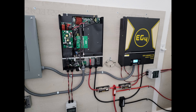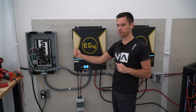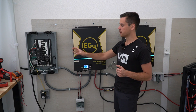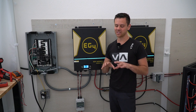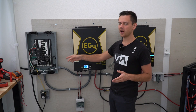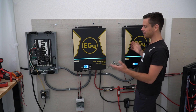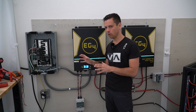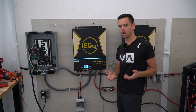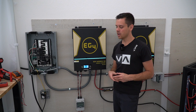I took apart this inverter and removed the ground-neutral bond, then tested for current on ground and verified whether the bond was present. I disconnected the grounds on the panel for both inverters, and it fixed the ground-neutral bond on this one, but when I connected everything back together and fired up the inverters, the bond was still present — obviously my fault, I wasn't thinking about the whole circuit, and the neutrals are still connected. If there's a bond anywhere in any of the inverters for a split-phase configuration, you will still have the ground-neutral bond. So I removed the ground-neutral bonding screw from the second unit as well, and it fixed it. There is now no connection between ground and neutral, and the single bond for this whole system is in the panel only. Credit goes to my forum members at DIYSolarForum.com for finding this solution.